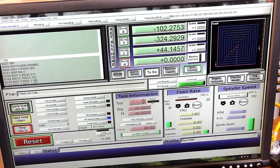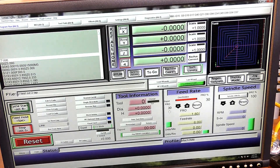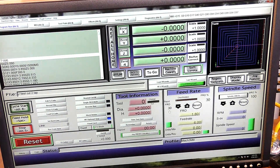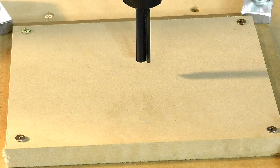This is what you do to simply zero the tool. We're going to zero the X. First of all make sure you're not in machine coordinates - when this is not lit that means you're in the work offset, the G54. In other words you're telling Mach 3 and the machine: this is going to be the start of the work. So Y zero and Z zero. I've got the feed rate at the moment set at 30% and we'll lift the tool off slightly, then start it going. Here we go - the first meaningful cut in action.